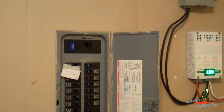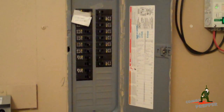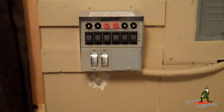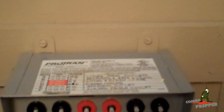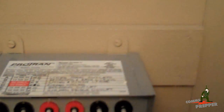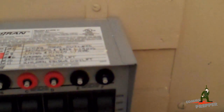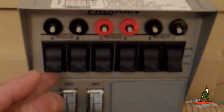Here's the retreat power system. I have my main circuit breaker panel connected to commercial power, and I installed a Reliance ProTran six-breaker manual generator transfer switch last summer. This box allows me to select six of my most important circuit breakers to run on a generator. I opted for living room outlets, bedroom and bath lights, living room and kitchen lights, kitchen outlets, bedroom outlets, and kitchen and fridge outlet. By throwing this switch I can go from commercial to generator.